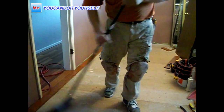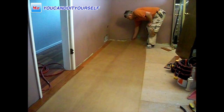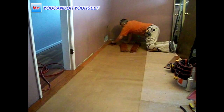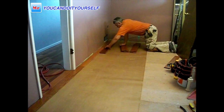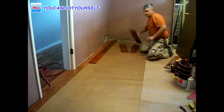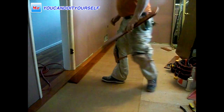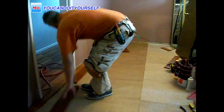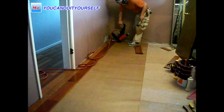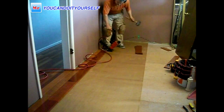When I sweep the floor, I then put the first row of paper — this is wax paper especially for hardwood floor installation. I take boards and secure this paper with one line of boards to avoid any movement of the paper when I want to lay out material over it. Then I use the nail gun to secure this line.